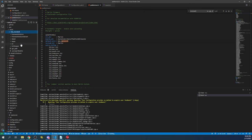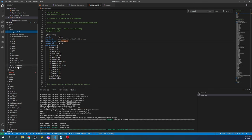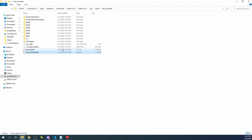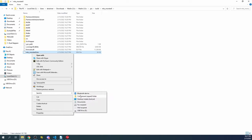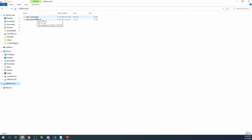The build produces a firmware.elf and then your actual .bin file. Right-click and reveal in file explorer. I'll show the last good install — MKS Monster 8 with a .cur extension — because the board looks for the .bin filename on load. Right-click and send this to the USB drive. If the board sees this file it will load it, and if successful, rename it. You can always rename it back to re-flash a different board.